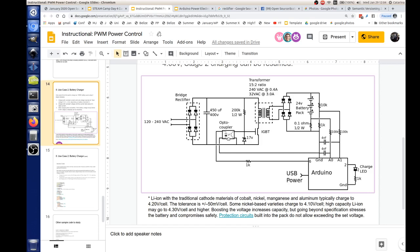I think it wouldn't work well if you take too high of a voltage and apply it directly to an Arduino. Like if we took 230 volts, even for short pulses, if you put that directly onto a battery, you'd get fireworks. At what voltage? 240, yeah. That's why we don't switch it directly and dump all that voltage directly on a battery. Here, at 100% duty cycle, you've got the 32 volts, so you are controlling this through what you programmed in the Arduino. Yeah, the average voltage.